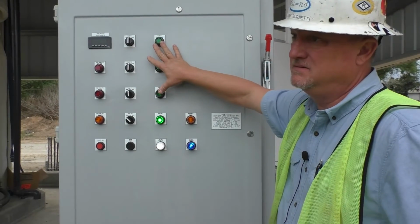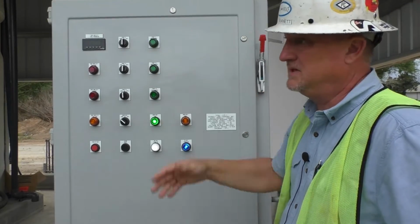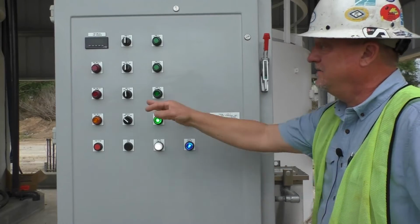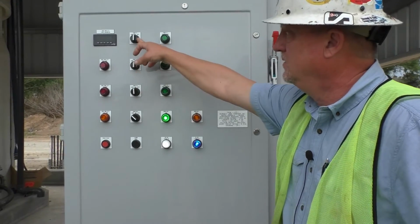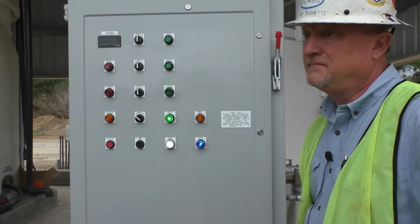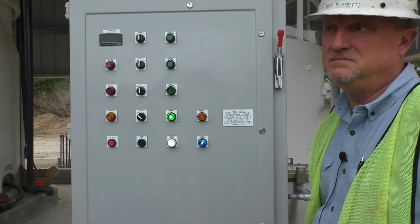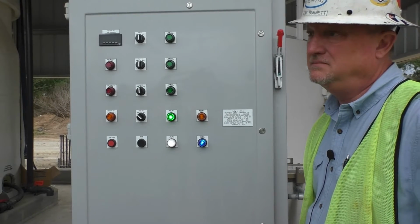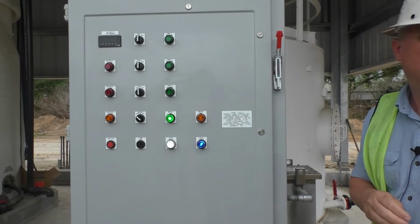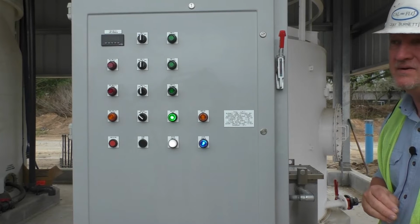These will still flush. The PLC will think you shut it off because it doesn't know where the power's coming from. So it will flush. And in auto, when the power comes back up, the pump should restart right away. But then it's going to do it again when the generator switches back. Yeah. Every time you lose power to it, it's definitely gonna flush, which is what we want it to do. It's designed to flush every time you shut it off. So if that becomes an issue, then maybe we can address it in the PLC.